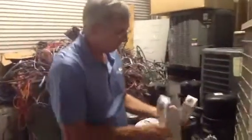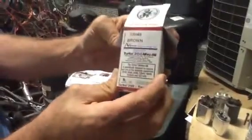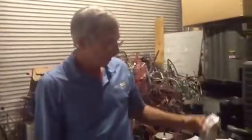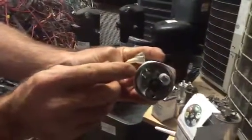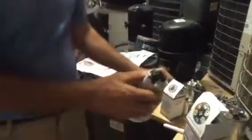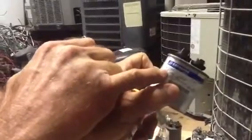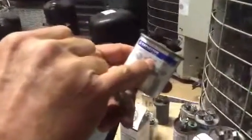Let's talk about them individually just for a second. The small turbo mini capacitor can handle anything up to 12 microfarads, and it can actually resolve and take away seven different capacitors. If you open it up, you'll see your fan wire — it's green, brown, and white. For instance, this is a seven microfarad capacitor. Don't be worried about the 370 or 440 volts that you'll read on these capacitors — that's not really going to make that big of a difference.